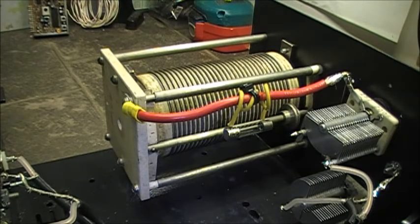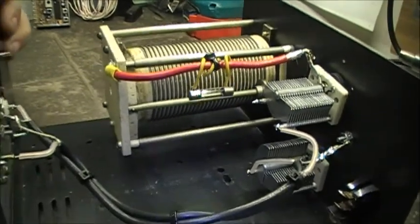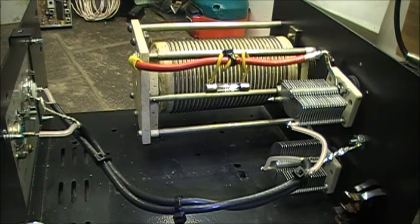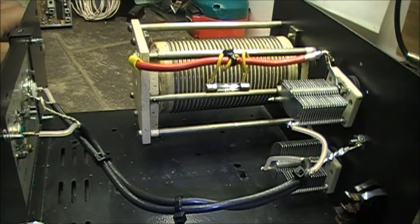Anyway, just wanted to show you that little project. It's just something that you can make on your own — just project number two for this weekend. I've been in building mode. Simple T-network tuner, simple and easy to make. All you need is a coil, a couple of tuning capacitors, connectors, a box to put it in, and a bit of coax.